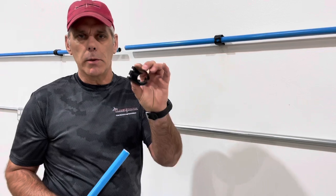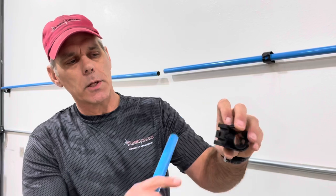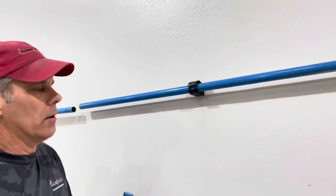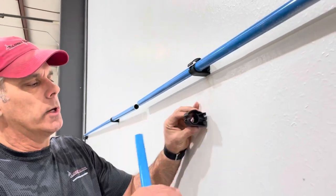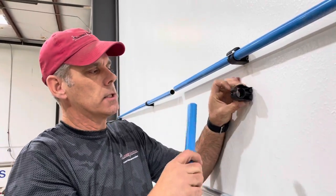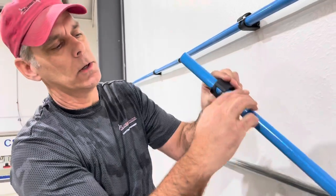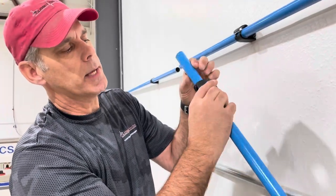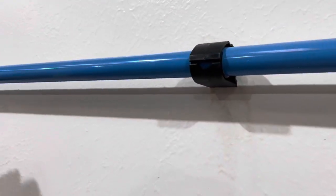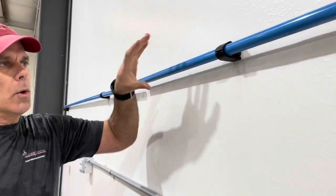For wall mounting this type of pipe, both companies have an integrated clamp that holds the pipe out off the wall. We've got a concrete wall here, so we drilled it with a rotary hammer using a quarter-inch bit, put an insert in, and that holds the clamp in place. Your pipe just drops in and kind of snaps into the holder, then a plastic clip secures it. It's nice and secure and you don't need a whole ton of these — it doesn't weigh a lot.